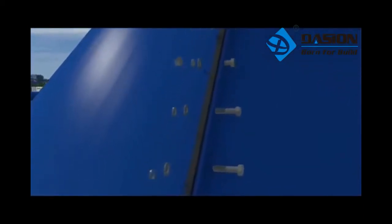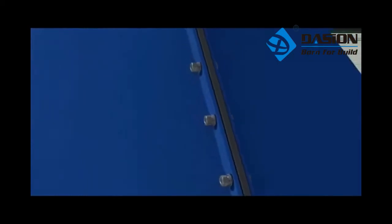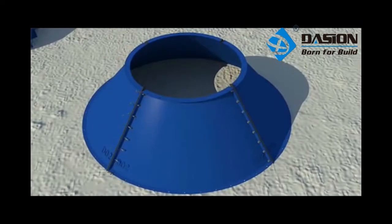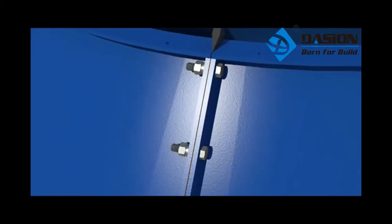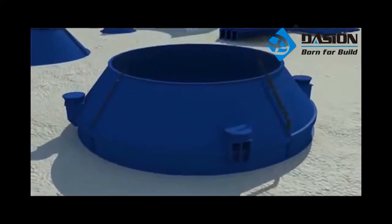Assembly of middle cone. Correspondingly place the adjacent sides of 4 sheets of middle cone as per A02 for A02, B02 for B02, C02 for C02, and D02 for D02. Insert the sponge rubber strips in center joint. All strips must protrude 5 to 10 cm beyond the workpiece, and then install the bolts. The middle cone of split storehouse is assembled completely after 4 sheets are connected and the bolts are tightened.